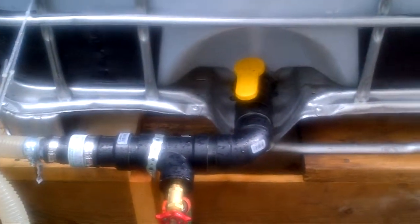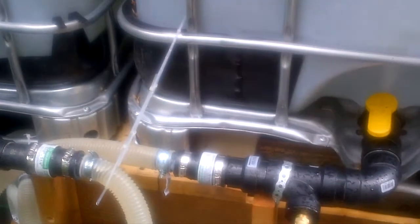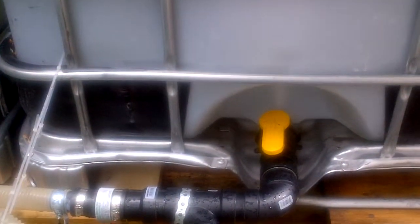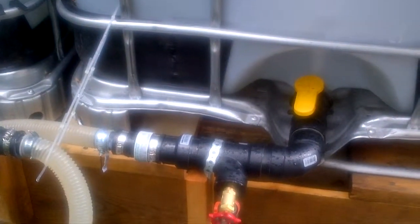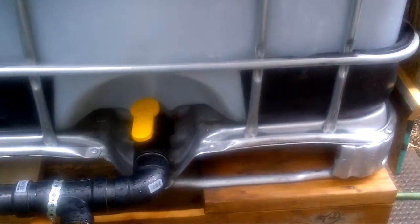The whole system can be isolated and removed easily just by unscrewing those connectors — you'll see those right here, they're just screwed on. When I put this together I did glue all the fittings that are below the top of the tank so they wouldn't leak, and I also glued all the fittings along the eaves trough. Everywhere in between I didn't bother, and it doesn't seem to be an issue.